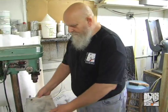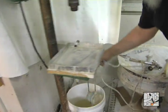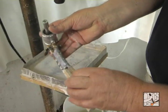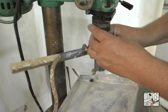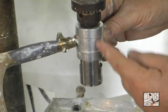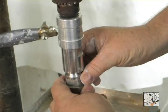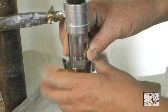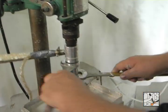What I have is a pan in which I will be putting my glass for drilling. I have my submersible pump. The drill head assembly has a valve onto which goes this rubber hose. The wood helps hold the jacket in place while I'm drilling. This is a drill head assembly — water flows through a hollow shaft and out through the drill bit. This will simply screw up into the drill head assembly. The bevel causes it to seat tightly — give it a nice firm seat.